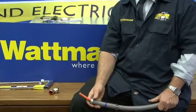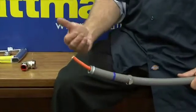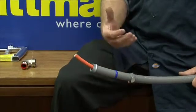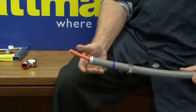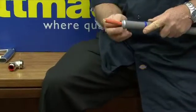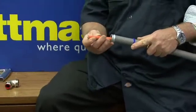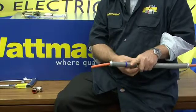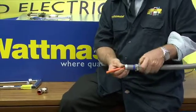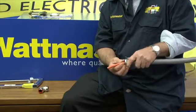I'm using a piece of orange circular cable, but you could well have three pieces of building wire, control cables, or whatever you need for your electrical installation — as long as you conform to the space requirements. In Australia that's governed by the Australian wiring rules. As long as you leave enough space for dissipation of heat as specified by the rules, you can pretty much do whatever you can imagine in this conduit.